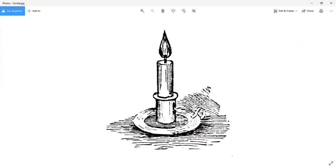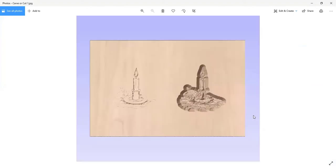And so using a V-bit, with the light shining through, this is the effect you get. So this would be carving it just by eye if we wanted to make a visual carving, but by carving most of the way through, you can see it looks very different in the preview. The thinnest parts left behind are the ones that are going to show through as white instead of black. So it's like a reversed image.